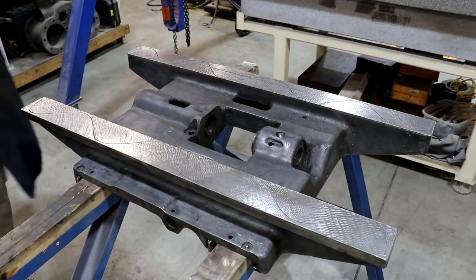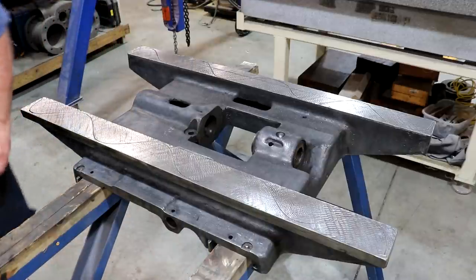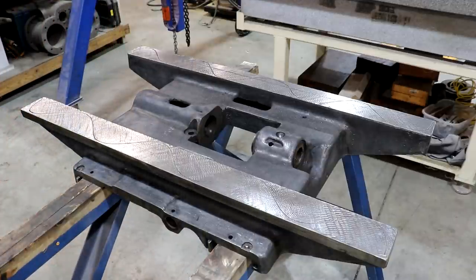After the first pass, we've got a nice crosshatch pattern on here. Until we put it on the surface plate and blue it up, it doesn't really mean anything — it looks pretty, it looks a lot better than before. But the truth is going to be in the bluing, and that's what we're going to be doing here in just a minute.